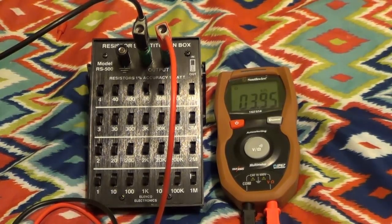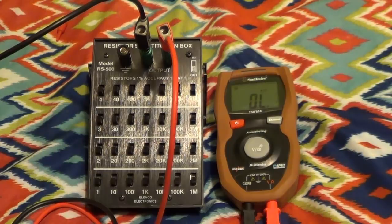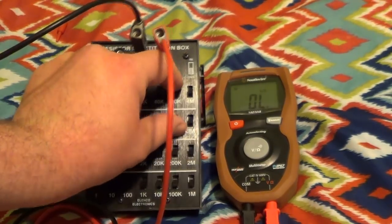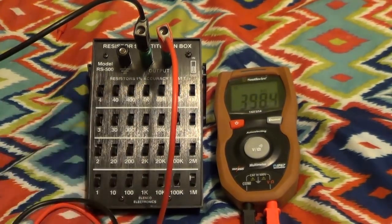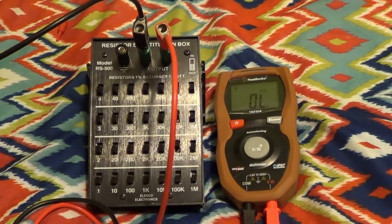It is here that I have to note a little bit of disappointment with this meter's capabilities. According to Southwire, the maximum possible resistance value you may test is 400k ohms. Even the cheapy DT830-based multimeters can do far better than that, with many of them being capable of testing up to 2 megaohms. It appears the meter will certainly go up to that limit but not beyond, so it is rather limited in its ability to measure resistance. That may have something to do with the design of the circuit and the auto-detection of resistance versus voltage measurement mode.